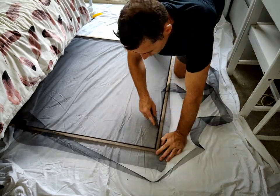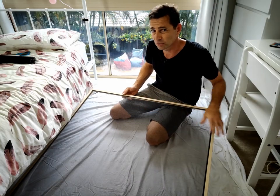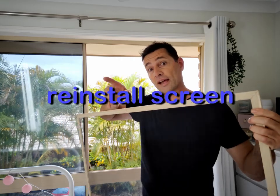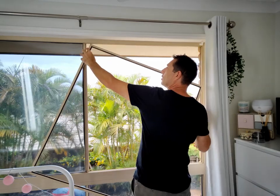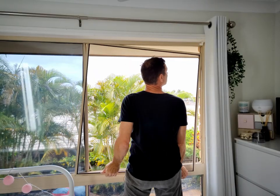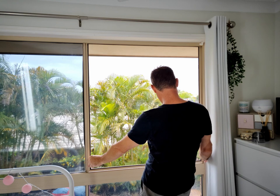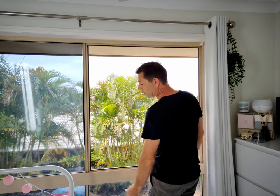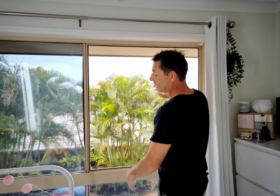With that excess mesh trimmed off it's pretty much done, but I want to show you a technique on how to reinstall this fly screen panel back into the hole — it can be a bit tricky sometimes. You always have the spline facing inside the house and that flat piece of panel on the outside. Get the left hand corner right up in the top track, put the right hand corner in the side track, lift it up, straighten it, push it all the way up until it's in its top track. Then wiggle and push it side to side until it pulls into the bottom track. Just manipulate it with your thumbs in that spline groove all the way around until you're happy with where it's sitting.